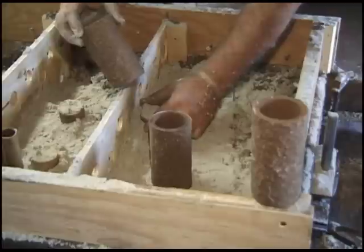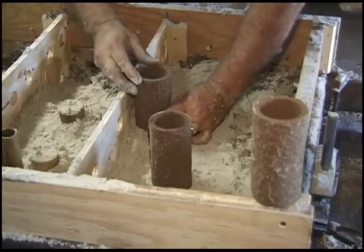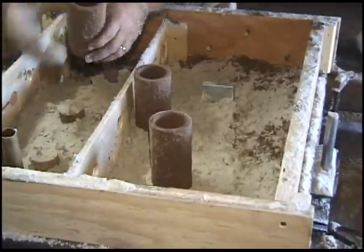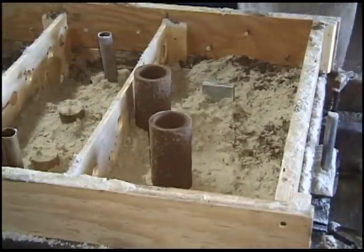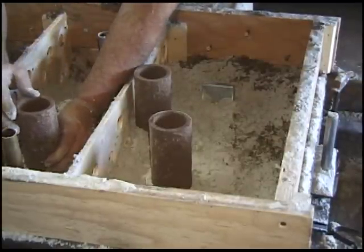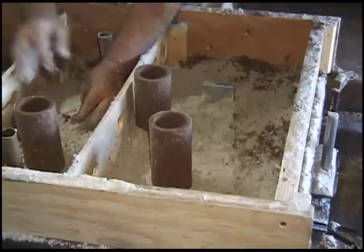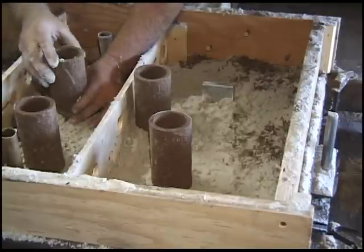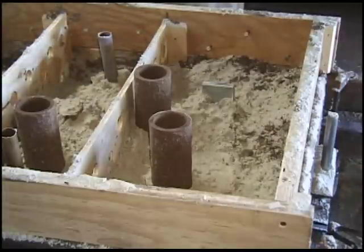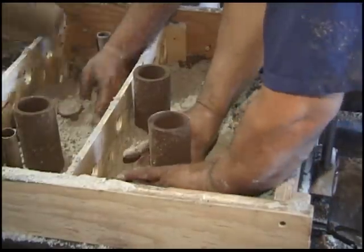In the production foundry, the foundrymen have a tendency to just throw the sand in and ram the molds up, the squeezer that's squeezing it. I don't always get it tucked carefully, but when we're going off to a one-off thing like this, we'll take extra care. Some of them have something that shakes them a little bit, vibrates slightly. Oh, yeah. In the big outfits, they got sand slingers that shoot that sand right down in there.